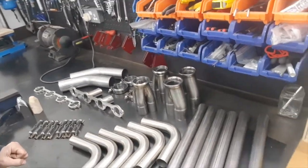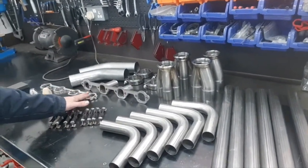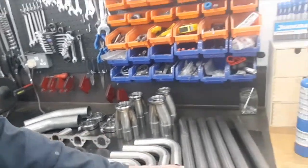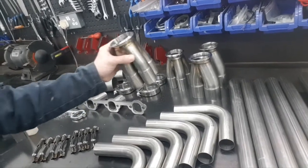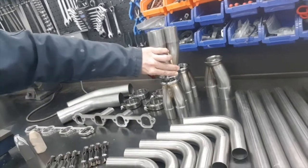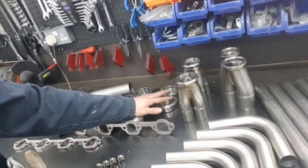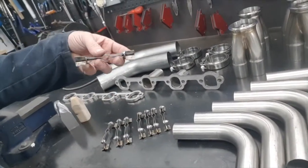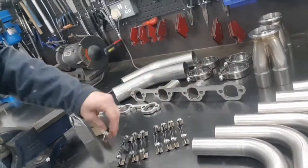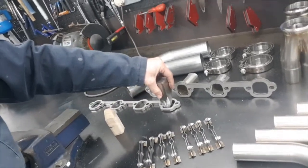It's exhaust time. I've just unpacked my box from Alinox. We've got some 1.5-inch 90-degree bends to come out of the manifolds, some flanges I've had for a while, straight 1.5-inch pipe to create the headers, some 1.5-inch collectors that go into 2.5 inch, some 2.5-inch male and female V-band rings into a twin-two setup, some extra 2-inch V-bands — four of those — and some 2.5-inch 45-degree bends.